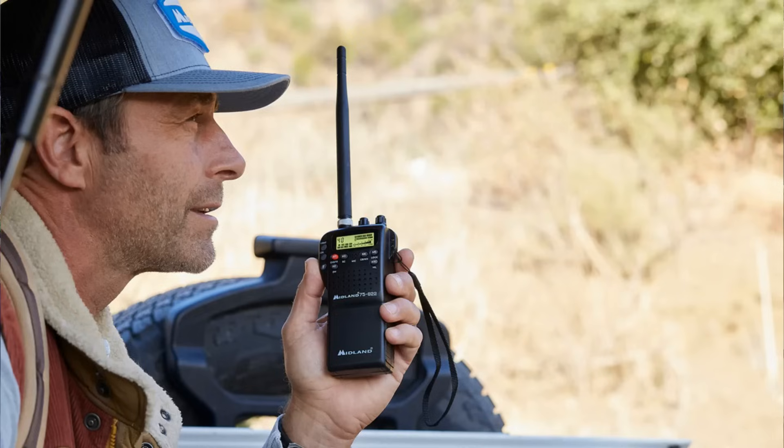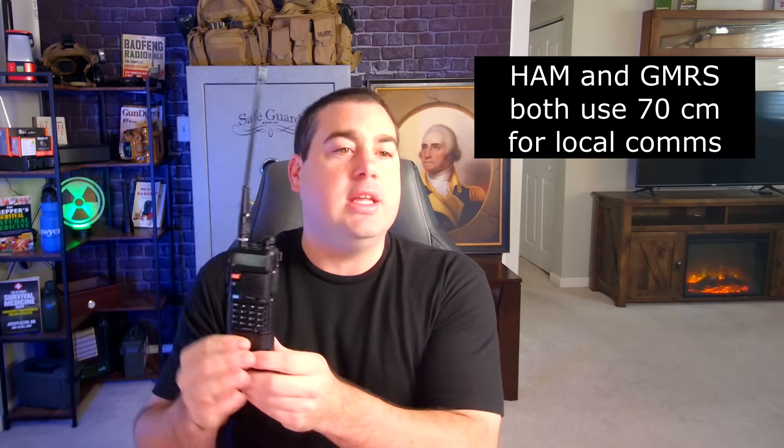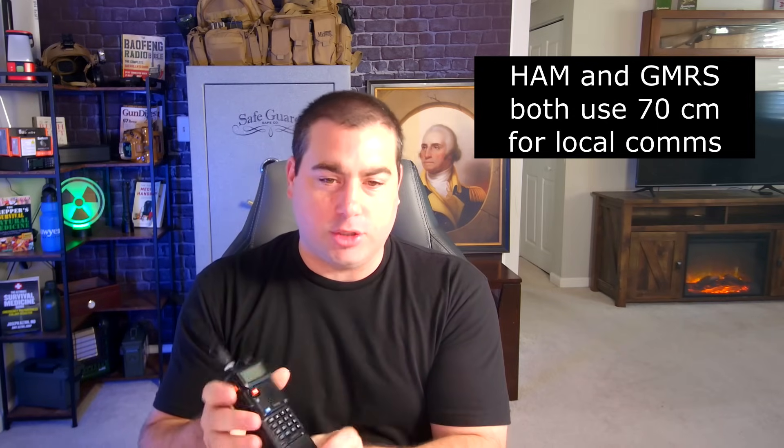An exception would be like a CB handheld. In my opinion, CB handhelds are basically worthless. If you want a good CB setup, you're going to have to set up a base station with a nice big tall antenna to broadcast that long signal out. Your Baofeng HAM radios like the UV5R will work from the 2 meter, 1.25 meter, and 70 centimeter bands where GMRS is. That's why you see a lot of people type GMRS frequencies into these on the unlocked versions and transmit GMRS on them.